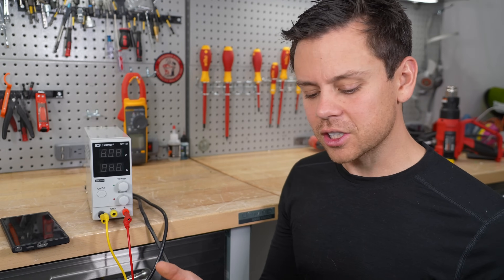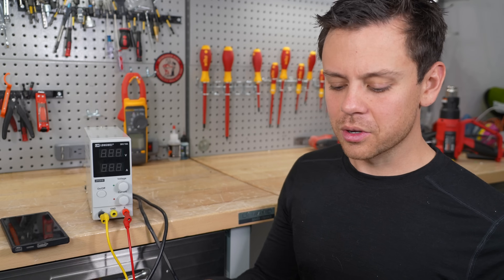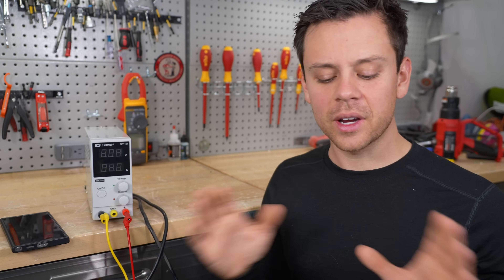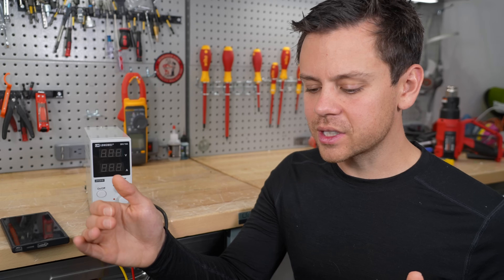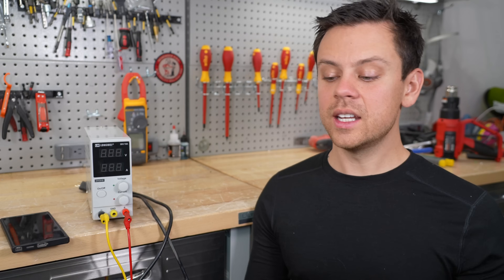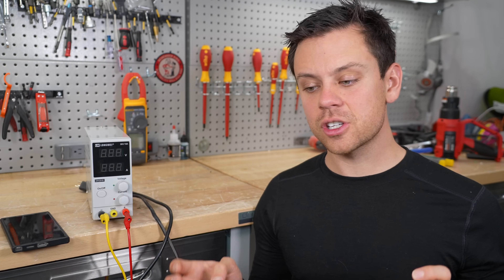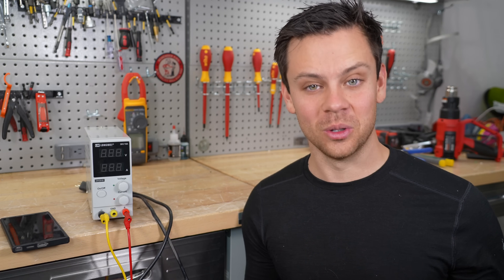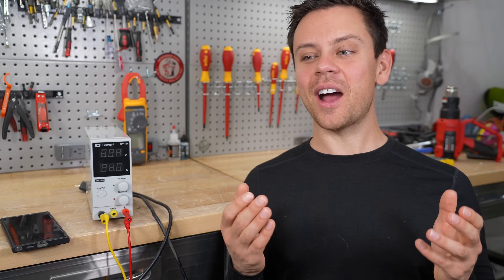You don't have to sit there and check the cell voltages every single day and get two or three active balancers and try to modify the cycling thresholds — forget it. Charge it to 100% and stop stressing about it. Now if you're really worried about degradation, do a capacity test once a year and see what your battery is actually at. You might be pleasantly surprised, especially if the batteries are being cycled indoors with solar. That's pretty much it for this video. If you have any questions, please let me know down below and I'll see you in the next video.